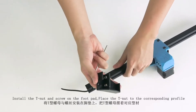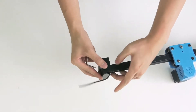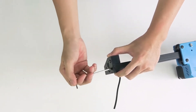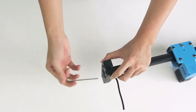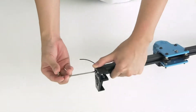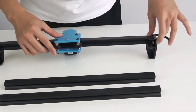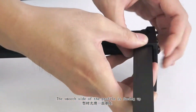The compressed spot technology reduces the ordinary laser spot from 0.16 mm down to 0.08 mm. With the same power, the smaller the spot, the more concentrated the energy, which reduces engraving time. Very suitable for amateur laser engraving, with low-light positioning and free positioning functions. It has a large carving area of 30 x 30 cm and a gantry-shaped design with no restriction on carving height.